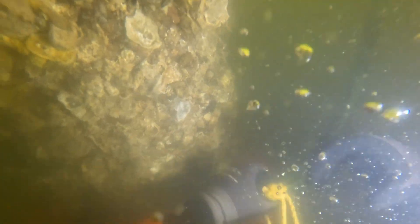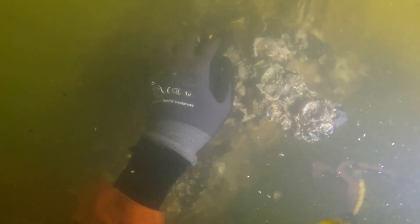It's definitely not always easy to spot problems like that oxygen leak. Keep in mind that what you're viewing now is about two to three times better than what the diver actually sees looking through the helmet. The diver is looking through a small face plate that's likely scratched up, fogged up, and there's zero peripheral vision. Another variable is that this pile is protruding about 10 feet from the seafloor, so I'm not just standing next to it — I'm actually hanging off the side with one hand, sometimes switching hands or wrapping my legs around the pile to lean back and use both hands.